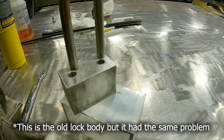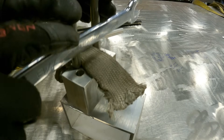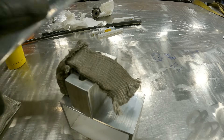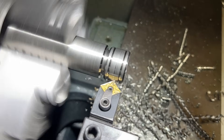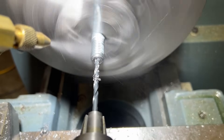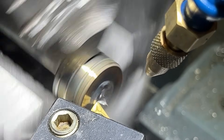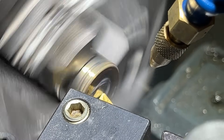As I was testing the new lock body, I realized it was really hard to work with because it was so hot. A slide hammer would make putting it together and taking apart a lot easier, since sometimes you need to give it some love taps. I used a large half-13 bolt as the slide and machined some pieces of stainless steel for the hammer. Being that it's a lock, I decided to put a security pin in the threaded hole so you couldn't just use any old half-13 bolt to take it apart. I drilled out the end of the bolt to fit past it, then machined off the bolt head and welded on a custom machined head to make holding it more comfortable.